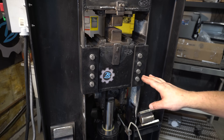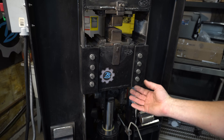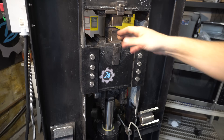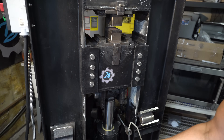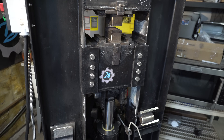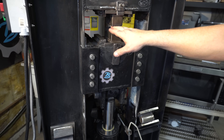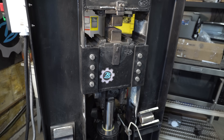With the cylinder on the bottom, the press presses up. A lot of people think they need the cylinder on top so it presses down, but it doesn't matter. It's much easier to have what you're working on at almost eye level because you're going to want to see it — when it's down low you can't see it and you're always crouching over. I prefer having the cylinder on the bottom. The whole thing is about five and a half feet tall because it's got casters on it.